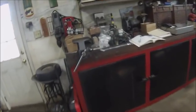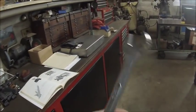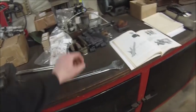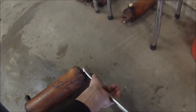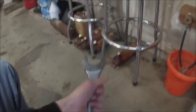And then I got this here fancy wrench. It's a Tactics 1 5/16", $11 wrench off Amazon. I couldn't believe I got it that cheap. And you're gonna think, well, I thought you didn't like cheap tools. Well, I do hate cheap tools, but because on these cylinders I had to make the wrench landing so short, our Craftsman and our Williams wrenches, the head's too fat, and when you put the wrench on there, it was hanging out past the rod like a 1/16 of an inch. So if you went to jam the nut on there, you'd jam the wrench on there.